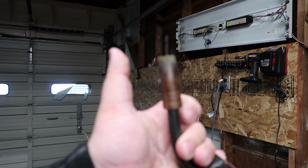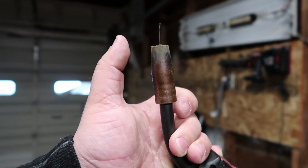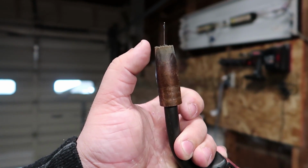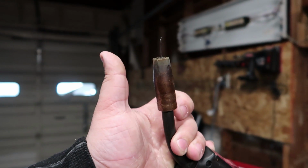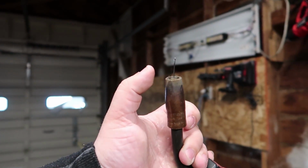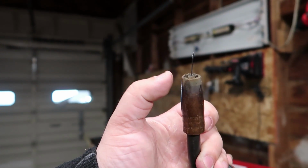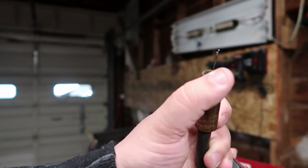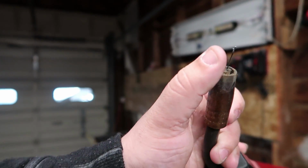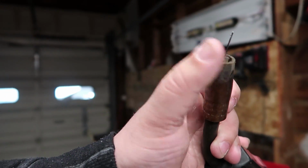I have experience with other machines, gas shielded machines, where you need this kind of nozzle to hold the gas around your weld. You don't need that with this because it's a flux core. But because I learned with this nozzle, I kind of use the edge of this as the angle that I use to drag welds. So that's why I put that back on there.